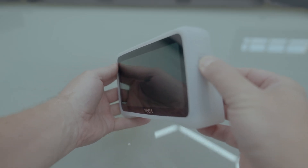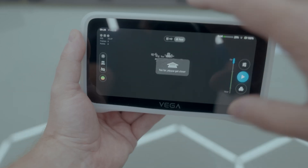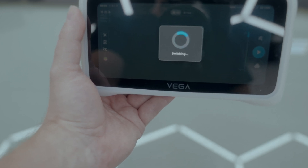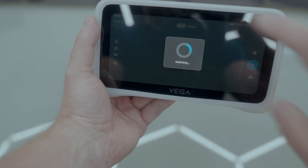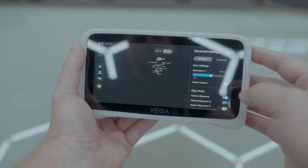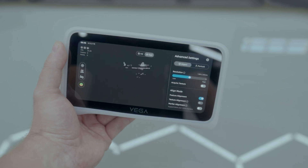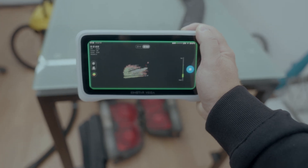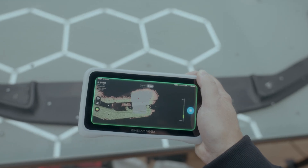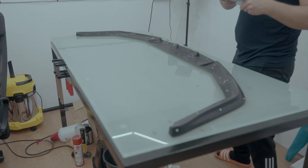So to get started, the first thing we'll need to do is scan this lip. There are two scanning modes: the HD mode is for smaller objects where you need all the fine details and high quality, and the fast mode — which I'll be using here — is for things that are slightly larger like our lip. There are all sorts of options you can go through and adjust, but we leave everything on default for now and see how it works out. After some testing, I slightly adjusted some options and activated the mark alignment mode, sticking on a couple of reflective markers, because that was improving the tracking and thus the speed you can work at immensely.